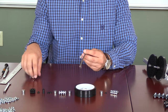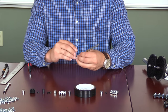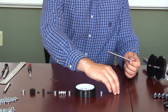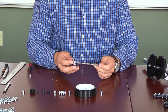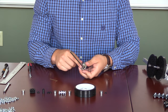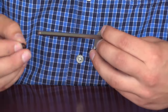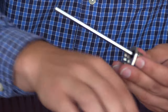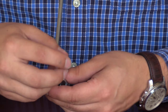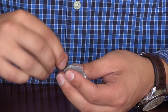To start the assembly, we will take a shaft collar and make sure it is aligned with the base of the shaft, then proceed to tighten it down. Next, we will take one of the bearing block assemblies and slide it on, making sure that the lip is facing the outer part where the shaft collar is aligned — you'll see that no lip is on the inside piece. Following this, we will take a 1.5mm spacer and slide it onto the shaft, followed by another shaft collar, making sure that the two shaft collars are lined up before tightening.